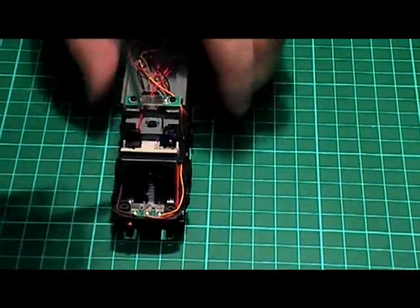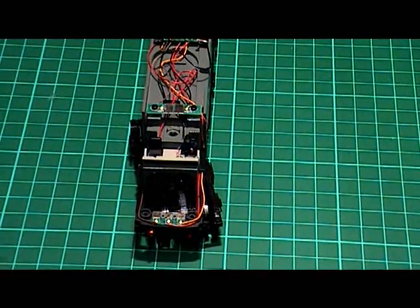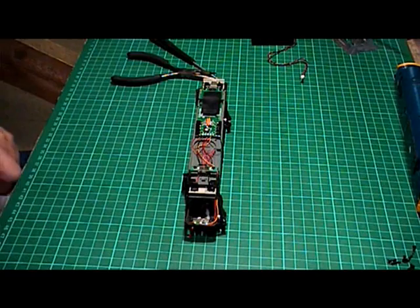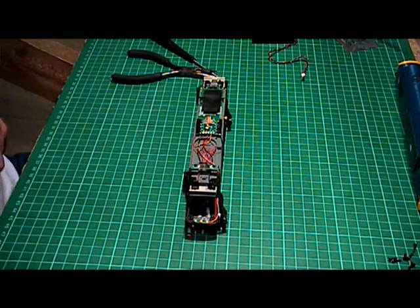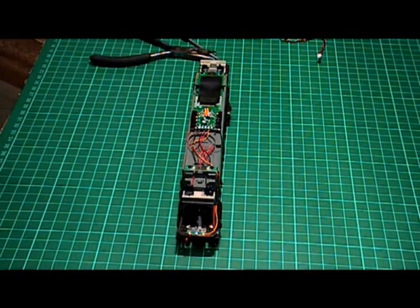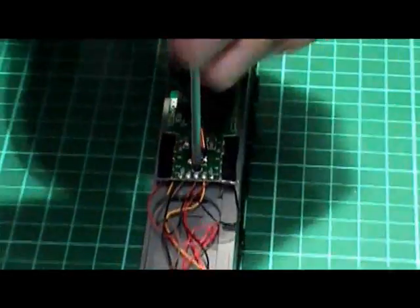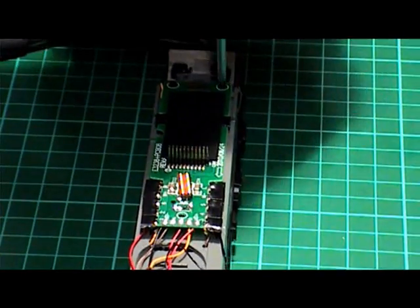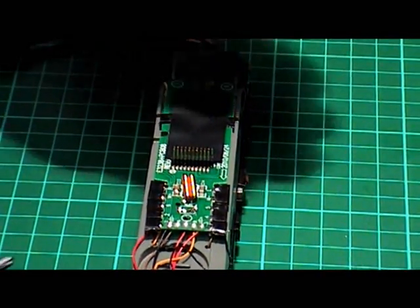There's a point I'll mention a bit further on: the first time I tried to put a bass reflex speaker into the tank, I decided to leave the bogies on and had them dangling by the wires. By the time the work was done and I came to reassemble it, one or two wires had become detached from the bogies and I had to solder them back on again. So in future I just remove the bogies - it's not too difficult. We've got the bogies unscrewed, so now we need to unscrew the PCB, which is only three screws - one in the centre and one on each side. Some Class 37 PCBs may be fixed differently, but there'll only be two or three screws anyway.